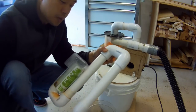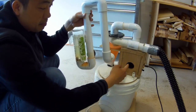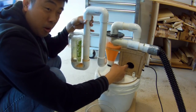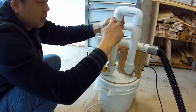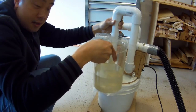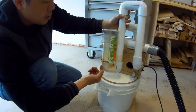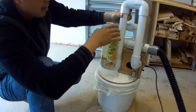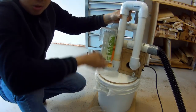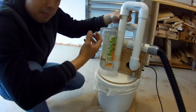The last component is the wet scrubber portion, and this part is really simple. All it does is pipe the exhaust air from the vacuum cleaner — which contains micron-sized and sub-micron-sized particles — and pass it through this S-shaped pipe that is submerged inside water, so it bubbles up. There's a tube concentric around the elbow, and when it bubbles up the water, it pushes water up to impact this cup and then flow back down. This prevents water from shooting everywhere and creates another surface for particles to impact the water and get embedded into it.